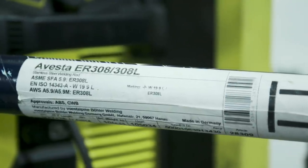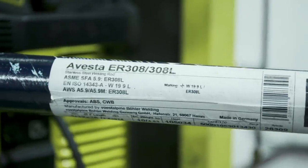We'll talk about the base metal and filler metal. The base metal was 304L, which is good material. For filler material, we used 3/32 308L filler wire — Böhler — for the TIG root. We then moved to stick and used 1/8 inch rod, which was a little big, but it worked. For the cap, we used MIG with 308L Si 0.035 wire.